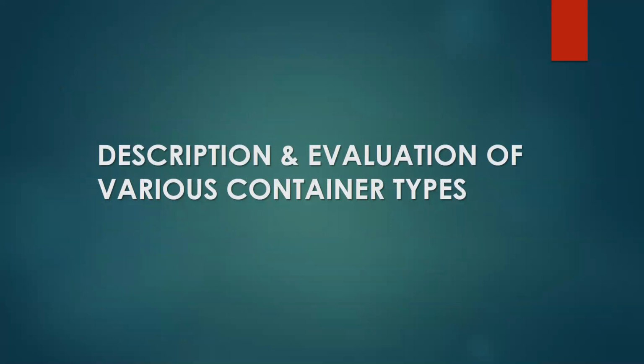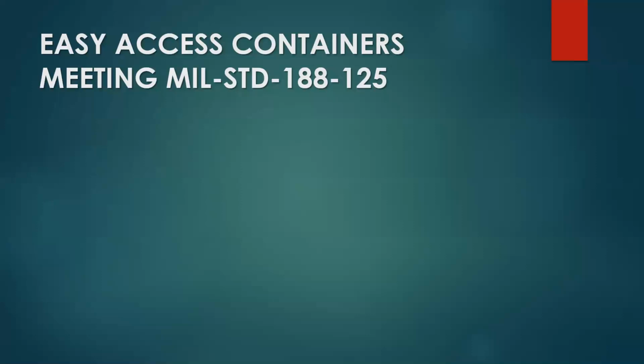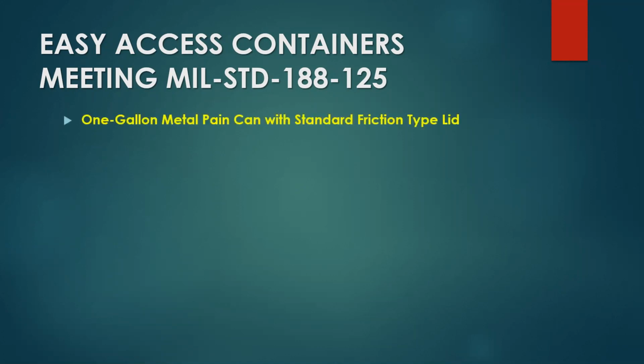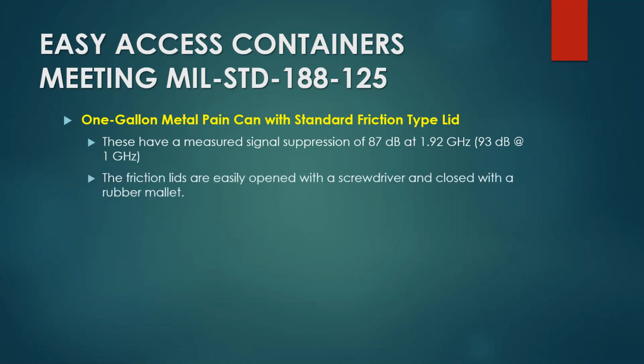So let's talk about various container types. I'm going to go pretty quick because I'm just going to highlight some of the things with each slide here. The first one is a 1 gallon metal paint can with a standard friction lid type. These have a measured signal suppression of 87 dB, which is great. The friction lids are easily opened with a screwdriver and closed with a rubber mallet.